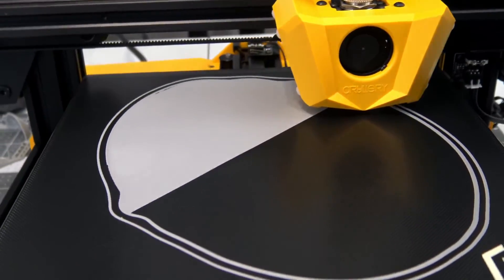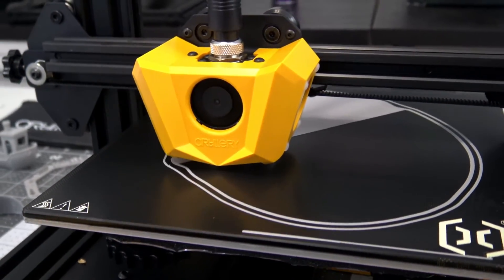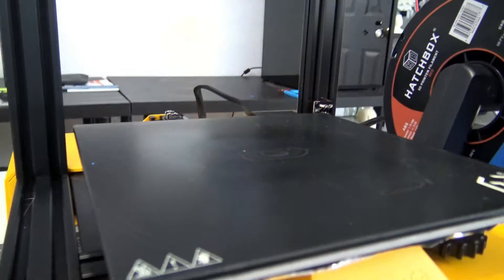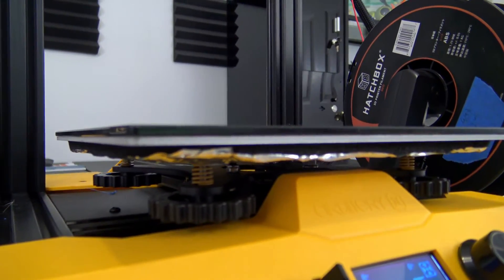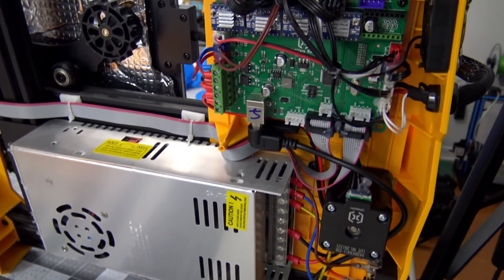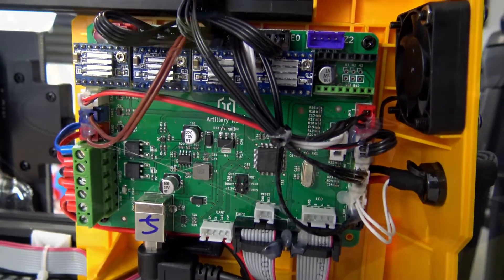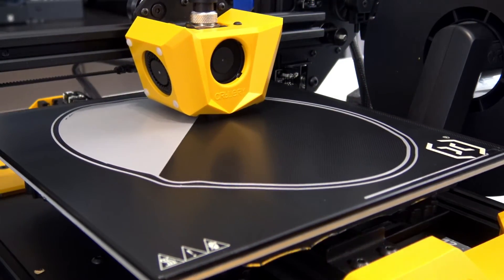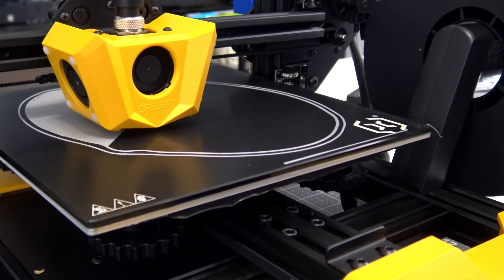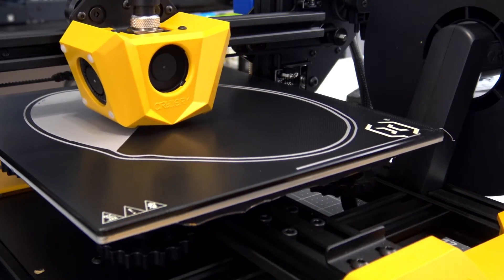The textured surface is perfect for PLA — the material sticks perfectly with no need for adhesives — but I had to use hairspray to get ABS to print reliably on the glass surface. The bed is attached to the Y-axis with four spring-loaded screws with large nuts, which makes them easy to turn to level the bed. The base also houses the 350-watt power supply and the 32-bit mainboard, which uses Marlin version 2 as firmware. The included motor drivers are amazing — when running, this printer is near silent. It is the quietest printer I have personally used, which was also Mrs. Hoffman Engineering's first comment when she saw the Hornet printing.